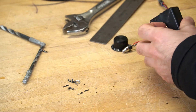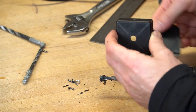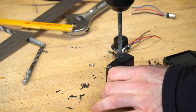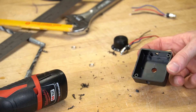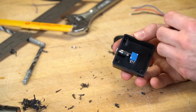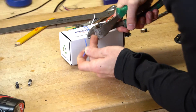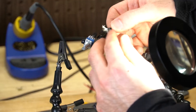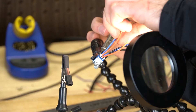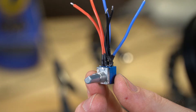It wasn't the correct side! I didn't fully drill the hole there — that's okay. But check your work! Thus completes the Swiss cheesing portion of this demonstration. To make things easier, I'm going to use stranded wire so that I can easily solder up outside the enclosure and then flex it into place. I've stripped these ground wires extra long and I'm going to twist the entire thing together so I have one connection to make.